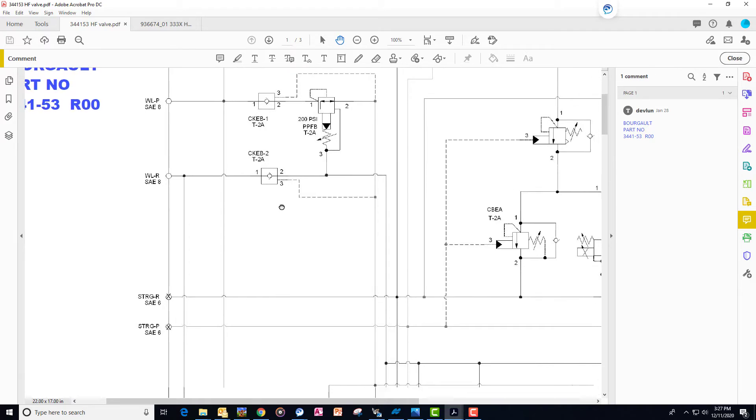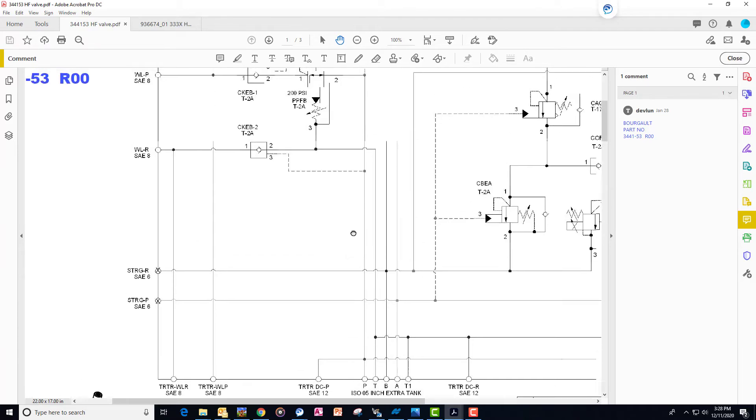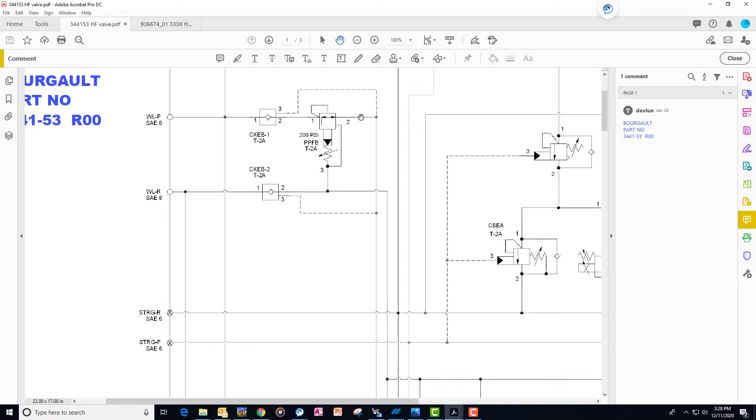These check valves get their pilot pressure to open from the P-port — the directional control — via the tractor hose DCP, which is a three quarter inch line. It doesn't go through the solenoid; it goes directly to apply pilot pressure to both check valves. That's why it's imperative that the oil engage in the proper direction with the directional control — that shuttles the ball over and opens up these check valves, effectively allowing those cylinders to move in and out. The pressure side, the base end, has a pressure reduction valve in the circuit — that's called inner wing down pressure.